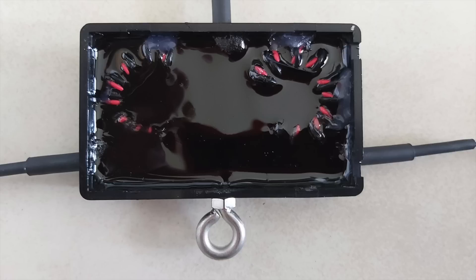Here's what's inside. You can see there are two toroid cores in there, but it's potted so I can't tell what it is or how it's wound — mystery balun for you. We'll see if that works. It's also supposed to take 200 watts, so you don't have to use it for QRP only.